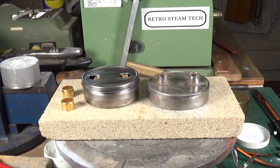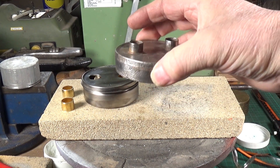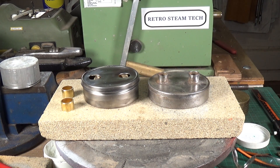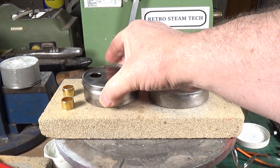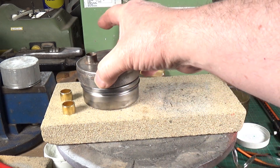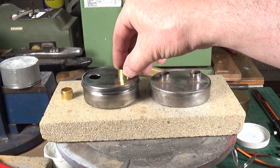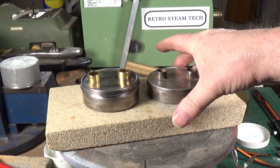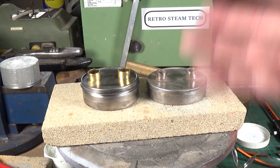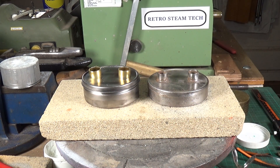I thought you might be interested in my solution to the burner problem. Here's the original, which sadly has rusted through to the point where there are many, many leaks. What I've ended up with is this — an old tobacco tin. It's not quite the same size: it's deeper and not quite the same diameter, but probably very similar capacity. I've cut a couple of holes in the top and I'm going to solder in a couple of brass tubes to make the wick holders. I'm hoping that will be as good as the original — a fairly simple and easy solution.